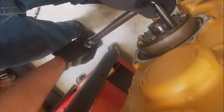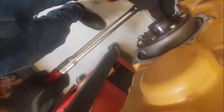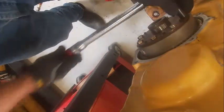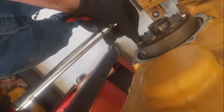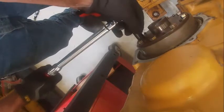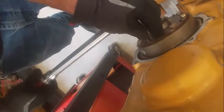A lot of these have a timing advance unit up here. I pinned my pump, I pinned my engine. Now I'm going to come around and torque down my bolts. This one's just straight timed — the pump has some advance mechanisms in the governor. Anyways, it's pretty simple to time these mechanical engines as long as you have the right tools. That pin I showed you — I've taken a bolt and ground it down before and used that. You can also see down in that groove how well it's lined up. You just got to use your head a little bit.